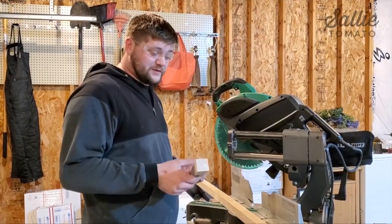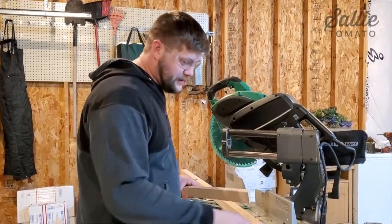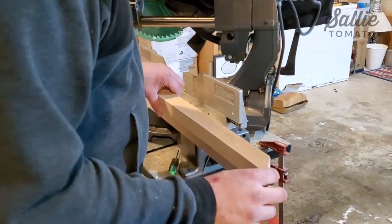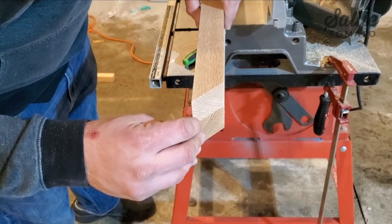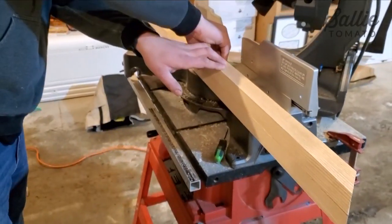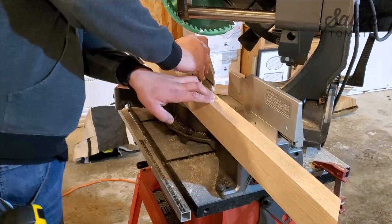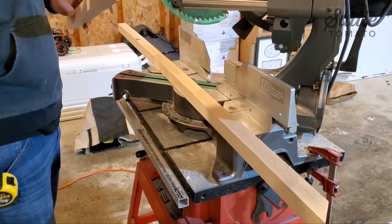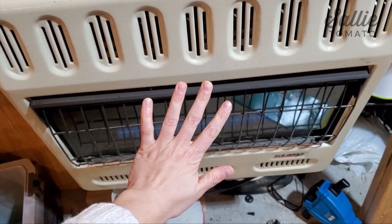Quick tip: once you're ready to cut one piece, measure and cut both sides like that, so you already have this piece over here. That way both your pieces line up perfectly — you can just butt that end up to the other one and use the first piece as a mark, then you're ready to cut. We have a propane heater going out here but my hands are getting numb.